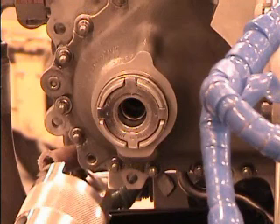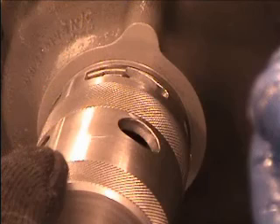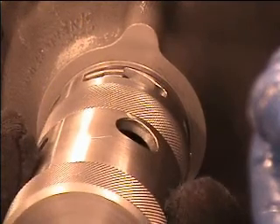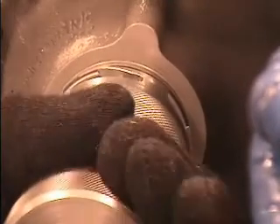Step B: Position the AXIS-G seal puller, part number 21C7239G01, over the AXIS-G seal so that the teeth of the puller begin to engage the anti-rotation lugs on the seal. Step C: Rotate the puller body so that the teeth are applying pressure to the seal lugs.